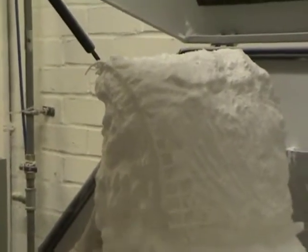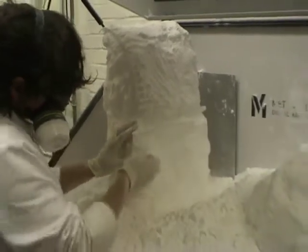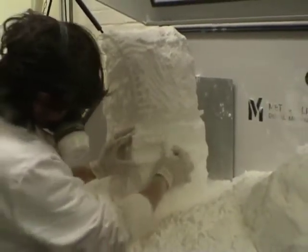Of course there are many more projects in one block, as the process always completes the same block. It is economically beneficial to put as many pieces as possible inside a single block. So the LED light, the Cobra LED light, is somewhere in the base. We can see that here. When the block is put on its side, we can see here the neck sticking out from this block, and that needs to be broken out. So the powder then needs to be removed and the solidified pieces need to be taken out.